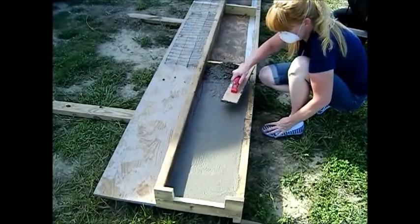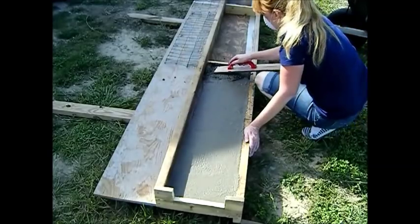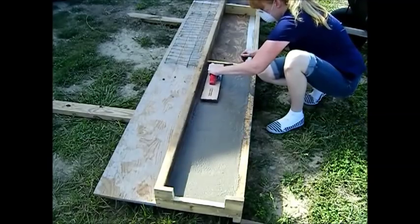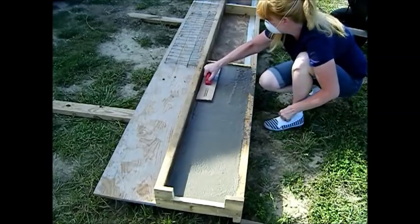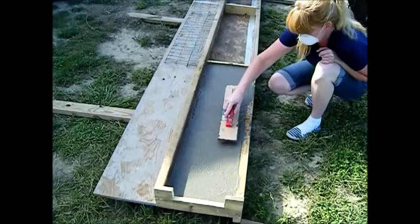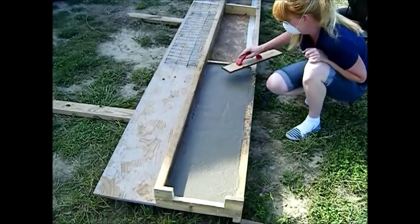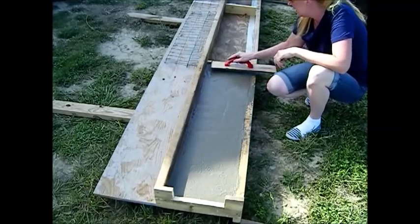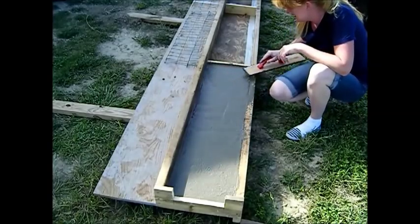You've got time to work with this, so just relax with it. Just kind of wiggle it like jello — see how I'm giving it a vibration? This gets the wetter stuff at the top. It gives a nice square edge, nice in the corners. This is not Quikrete, so you've got some time to work with it. This also helps give a nice smooth side, because we're going to knock these off and I don't want rocks showing on the side. I'm going to get all the bubbles out — still a lot of bubbles. I slide like this to the side and I want these corners to be nice and settled.